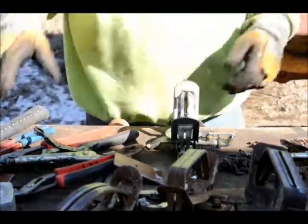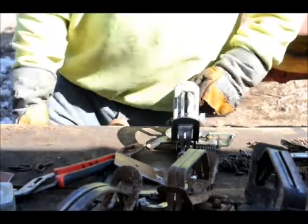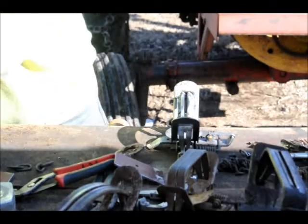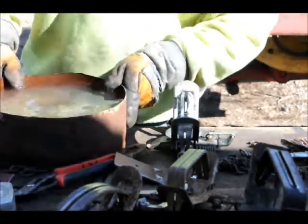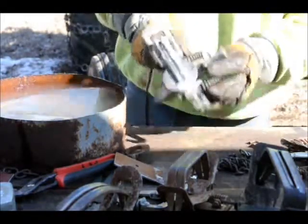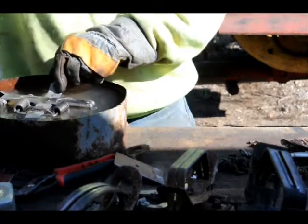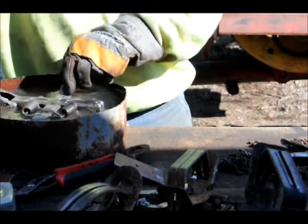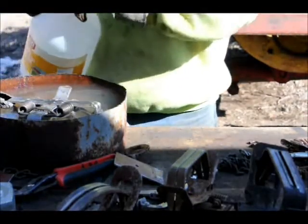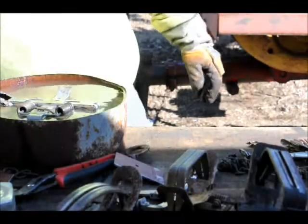Take the spacer out and now we can go to the next step and do the bottom. With this, I wasn't concerned about the heat on the jaws, but what I've got here is a tub of water. This tub is four inches high — you can make it four and a half if you want. What I do is set this in; I want the springs in the water. I want that pin that the springs are around to be in the water. I've been doing a few here today, I'm going to have to add some. Anyway, you just bring that water level up, and what that's going to do is keep things cool.